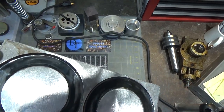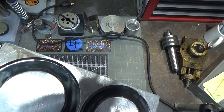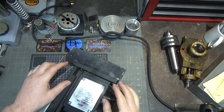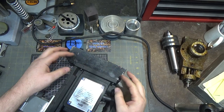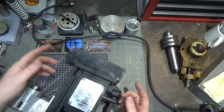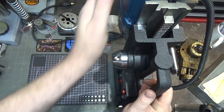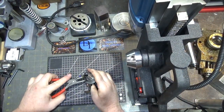When I was talking about the two coils — here are the potted coils of the electromagnet. There are two of them and they are separate; you could potentially control them separately. What would be really handy is to add an XY table to this unit so you could micro-position it: lock the electromagnet down and then position the drill anywhere you want within a short range — a couple of inches in each direction would be more than enough. I suspect some better units have that. Let's pop the circlip off here.